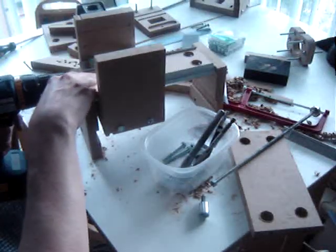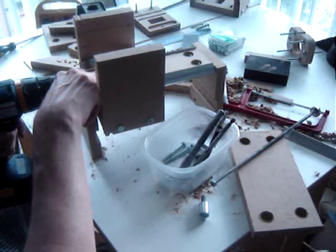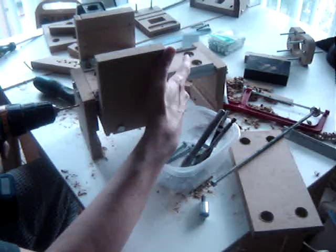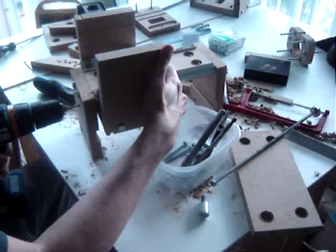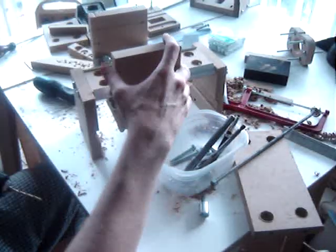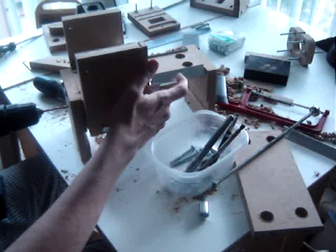Put it all back together so we can drill into the z-axis back. Drill as far into the back as possible. It's probably a good idea to disassemble the back and drill it on a flat level surface. The drill bit needs to be as level as possible — this hole will dictate the alignment of the lead screw assembly.